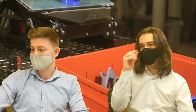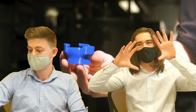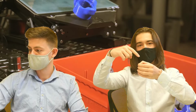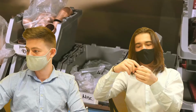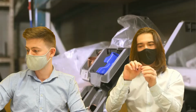I wasn't even talking about that. Remember, I can pull up that picture. The extruder arms got chopped by the filament wearing through it. The arm that you squish to tension your extruder, because this is one of those really non-obvious things. Because of the way we were mounting the filament in our printer rack, it was coming into the extruder at an angle, and the extruder is pulling the filament at this angle. Only because we were printing so much, because the printers are automated, did we actually experience the filament slowly wearing away at the edge of the extruder to the point where it basically cut through, got stuck, and broke the extruder.